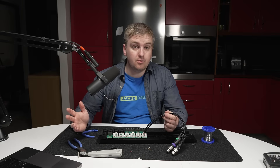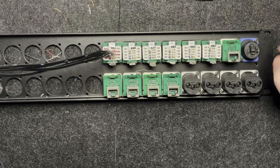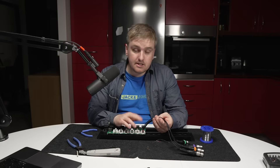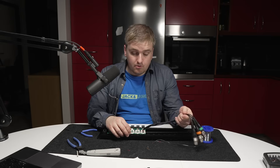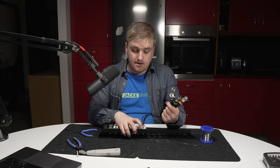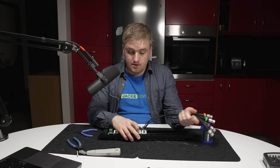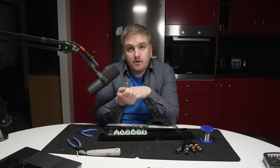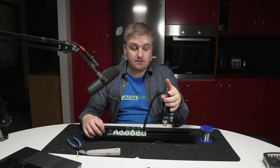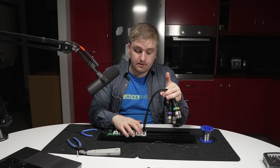This is essentially how easy it is to do audio over CAT cables. Just get these through connectors and you can build your own tails however you want. This is just a very short introduction on how to use these and how easy it is to do your own thing. For example, this could be going into my mixer and then I could run a CAT cable into my in-ear racks to do two stereo in-ears on one CAT cable. I always design my racks so that I only need one outlet and can just loop through the power.